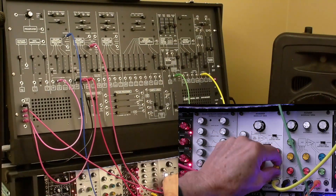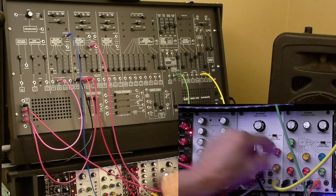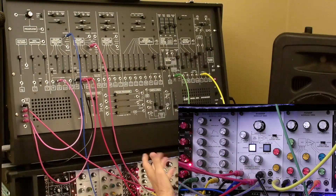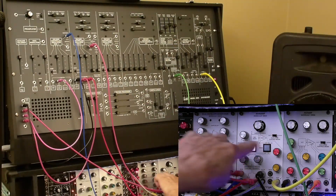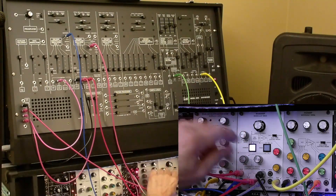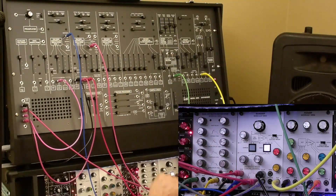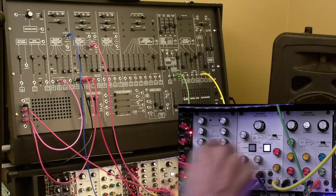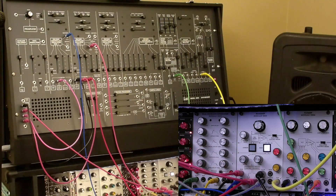We've also got a volume control here. When we're in unmod, the input B attenuator does nothing because it has switched it out of the signal path and substituted a DC voltage in its place. When we go to mod, it reintroduces input B into control of the balanced modulator, and you get this funky modulation that's similar to what you'd get with a ring modulator.